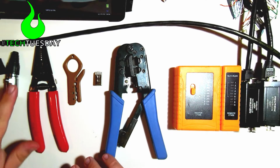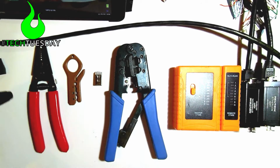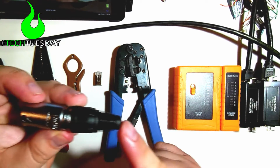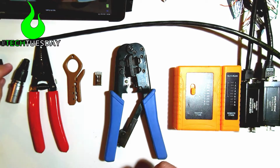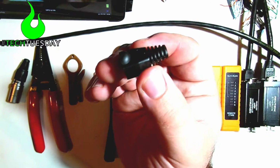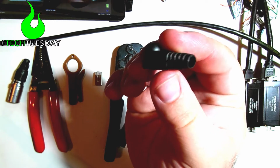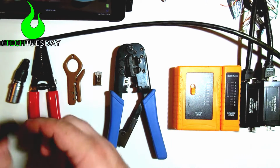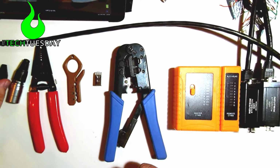You'll need some sort of strain relief boot. So today we're doing EtherCON, so we've got the strain relief boot that's built into here. But in the description, if you're making just plain cables without the EtherCON connector on there, you can find a strain relief boot like this that will work as well. And I'll also talk about making patch cables, so you'll need to use that for that.